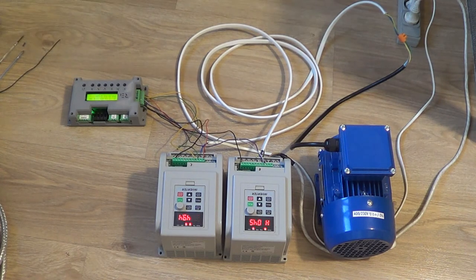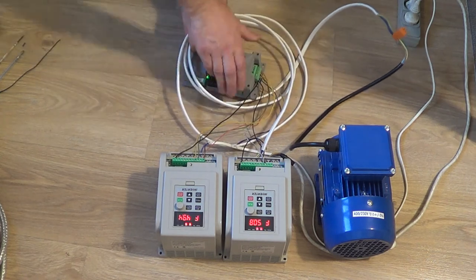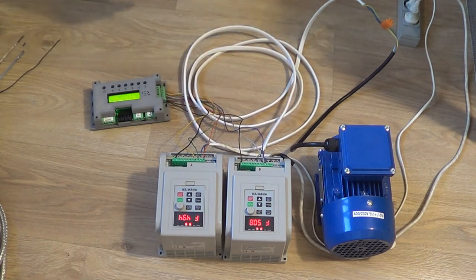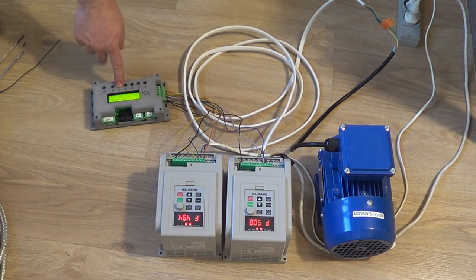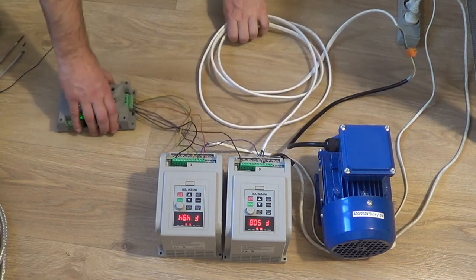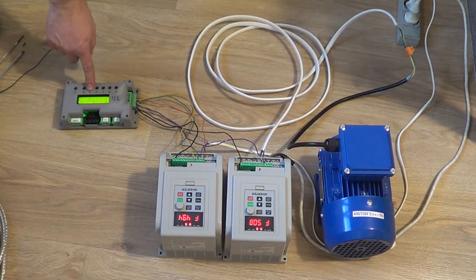So let's do it. I'm putting the loop here, going with the signal cable through it, and see what's going on right now. As you can see, the inverter is not working — sometimes it starts and in most cases it just starts the signal and stops, starts and stops. Now I've taken the cable out of the loop and everything is working perfectly again.